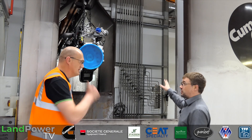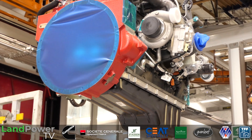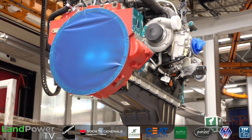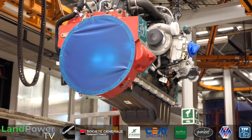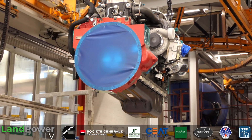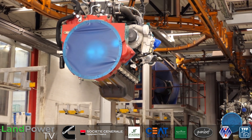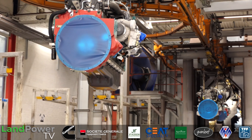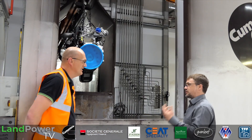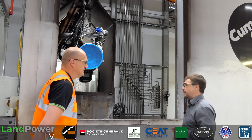After this, we've got basically a three-stage oven. The first part's flash off - that's just a bit of warm air that recirculates around the engine, which starts to get the solvents coming out of the paint. We then go into an infrared oven - there are 12 infrared plaques in total in different banks. That really just gets the solvents out of the paint and starts to dry it out.